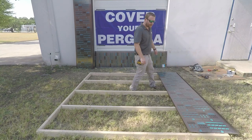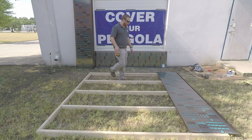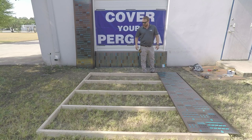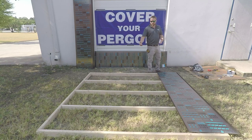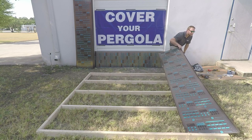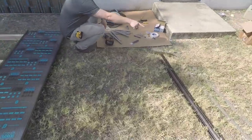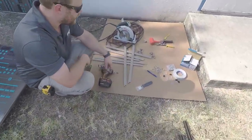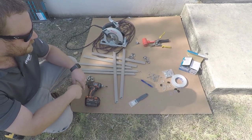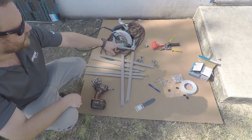This product is used on a pergola setup on purlins or stripping. I have a small 8x8 pergola top set up here with stripping going across, framed out. Everything you need is set up: the sheets themselves, caps we'll cut to length, flute covers, smaller flute covers, U-profile, screws for the sides, clips for the profile, pancake screws in the zip-lock bag that hold the clips down, and vanity pieces — end covers and U-profile covers.